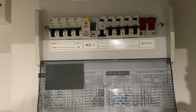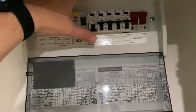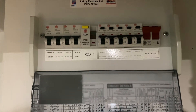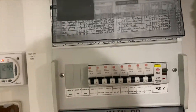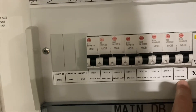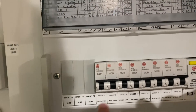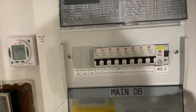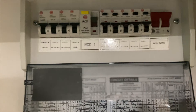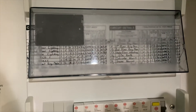At the weekend if the customer is at home and they have an outside lighting fault, they lose that one circuit — they don't end up losing half of their house. It's much less inconvenient for a customer to lose one circuit, opposed to losing one, two, three, four, five, six, seven, eight circuits. In that case they'd lose their kitchen sockets, first floor ring, second floor ring, underfloor heating, spa bath, intruder alarm, smoke alarms, and driveway feed. With an RCBO they would only lose that one circuit, so it's a much better setup for the end user.